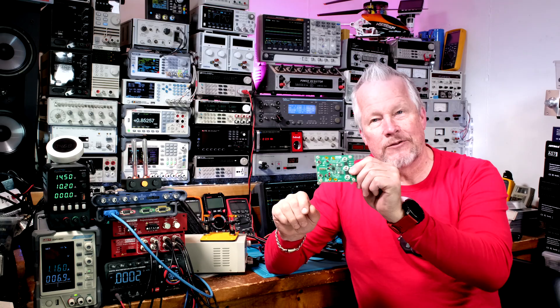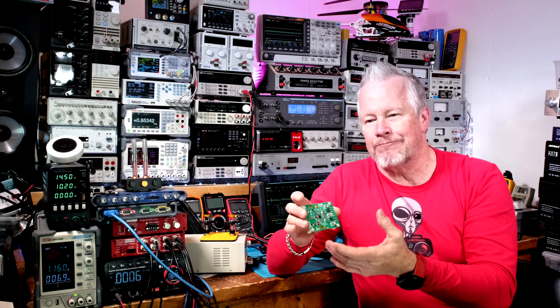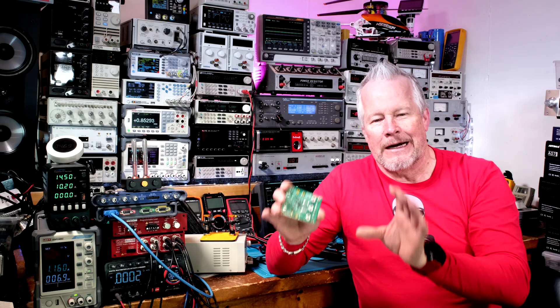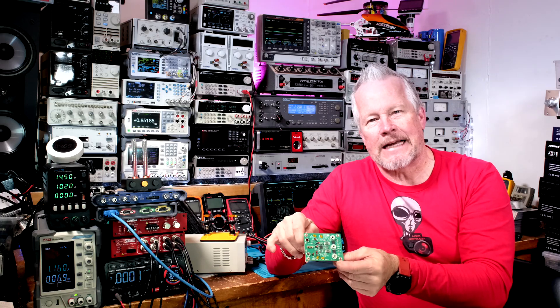Let me know what else you'd like to see on this board. I've been beating the snot out of it, turning on and off different power loads with the active load. Active loads just pull current regardless of voltage — a brutal way to test a power supply. If I really wanted to evaluate just noise, I'd run it into a resistive load instead, but the active load keeps the comparison fair side by side. Anyway, let me know what you think — hope you like these videos, appreciate you watching, see you next time.